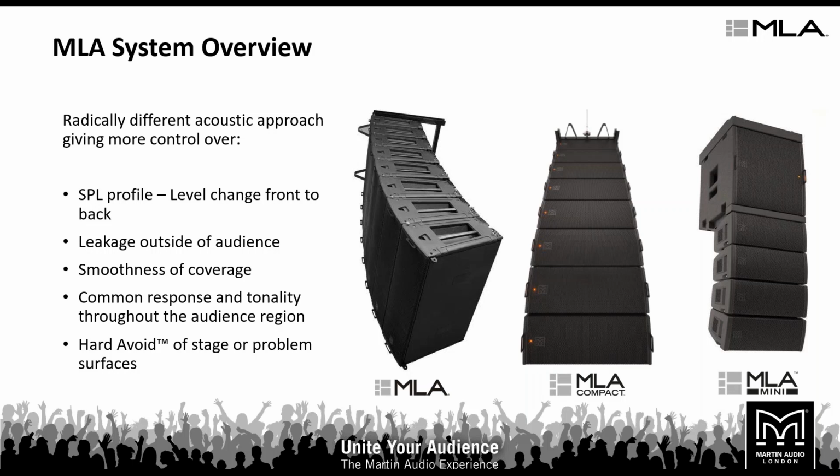And of course we have MLA, which is our double 12. This was quite a revolutionary speaker system when it came out. Although it's about 7-8 years old now, it's still very much at the forefront of loudspeaker array technology. This system allows us to control an SPL profile from the front to the back of an audience, so within reason we can dictate how the SPL drops off from the front row to the back row. We can also control areas that we want to actively avoid. So if there is a balcony causing reflections, we can use this technology to remove some of the effects of that reverberant field on the rest of the audience. This is very much about increasing the direct signal to the audience areas and avoiding the areas where you do not want reflections or reverberations.